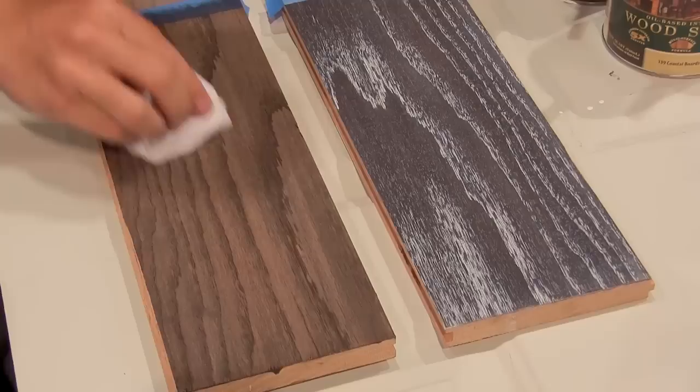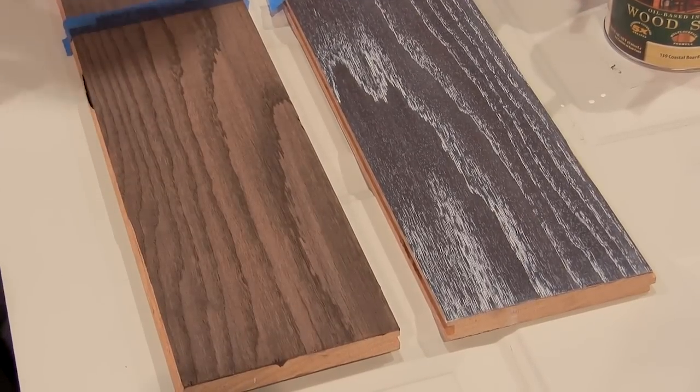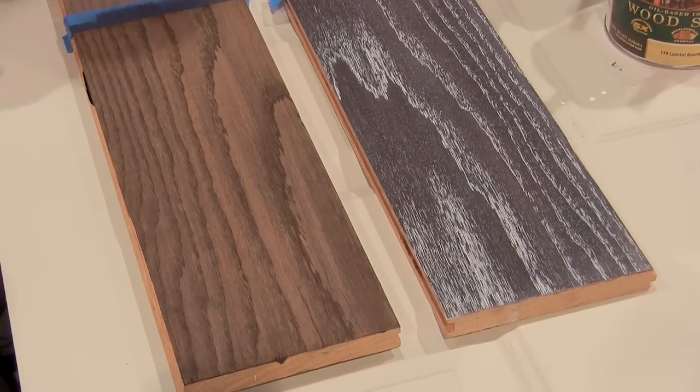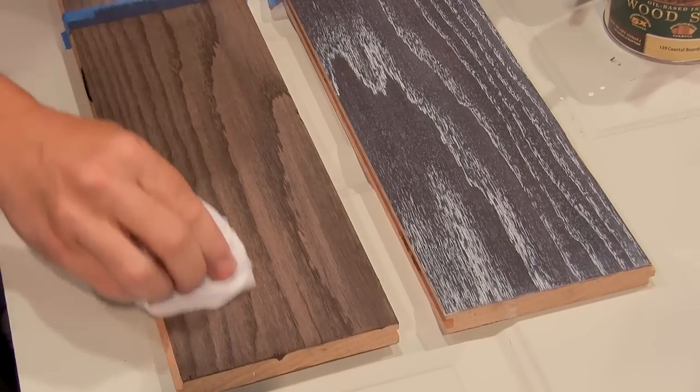And eventually that gets worn out, and you want to refinish it. Well, to get that same look, you're going to want to use this exact technique. Cool. Now, once this glaze coat is dry, you're going to want to protect it by applying one or two more coats of ZAR polyurethane. So just like any other floor at that point.